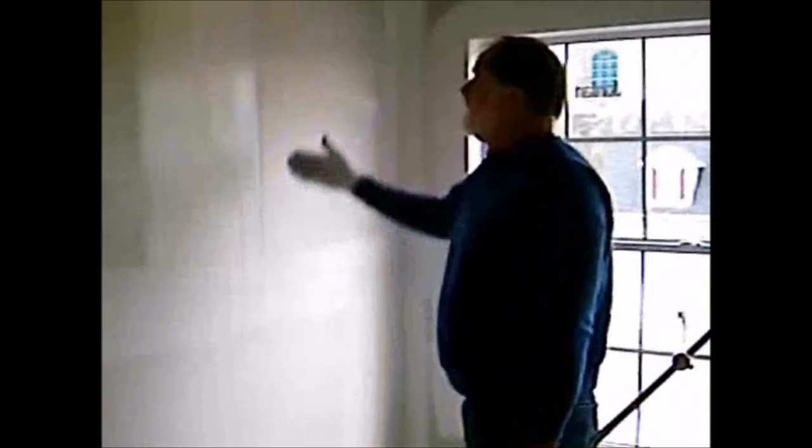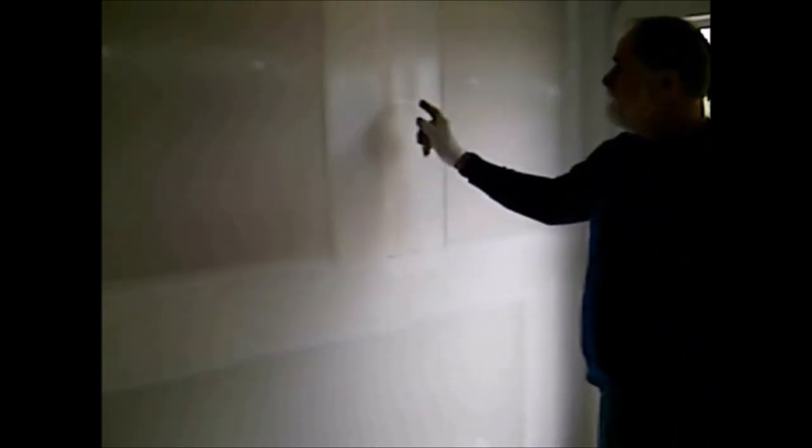I don't leave any wet mark or additional mud to clean up or anything. So it would just need to be crossed off, and that would be it. And you have a nice finish on your butt. You have a very slight crown on each side. All you're really trying to cover is the tape, because that surface is flush. So that's all you need to finish a butt. It's very simple, and it's extremely quick with a box, and you can't do it without.